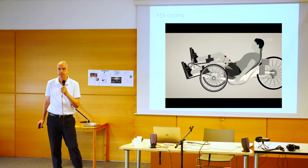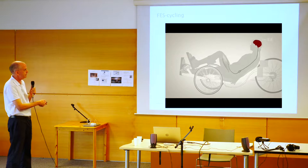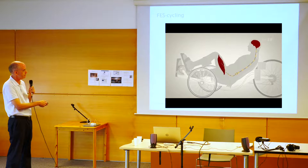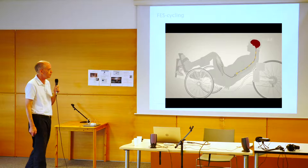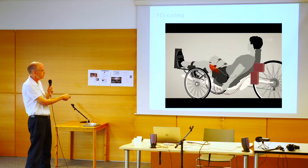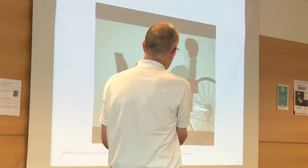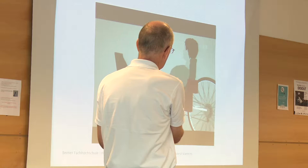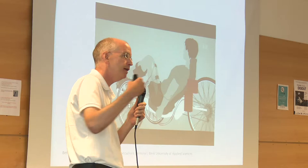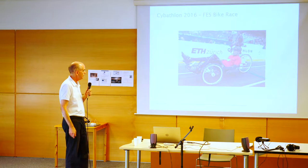For anyone not familiar with FES cycling, this short video shows how it works. You can see an individual on a recumbent tricycle with normal innervation from the brain and spinal cord to the large muscles that move the legs. Following a spinal cord injury, we use an external system — an electronic stimulator connected by wires to surface electrodes positioned over the quadriceps muscles. The control uses a measurement of crank position to switch muscles on and off at the right time to produce positive torque.